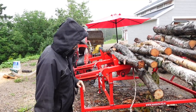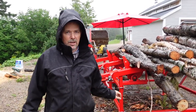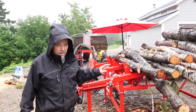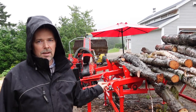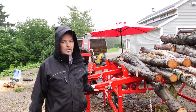So the first thing you need to do is keep steady wood coming into that firewood processor to make it pay. So this unit here cost me about $5,000 about 5 years ago. I think they're much more expensive than that now. It's got some drives on it. It's gravity fed. So you load up the wood and you feed it down through a log at a time into the throat of the processor, and away you go. I highly recommend that you add one of these to your arsenal early on.